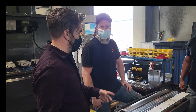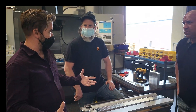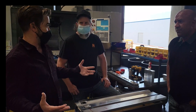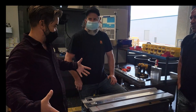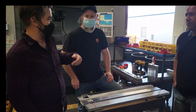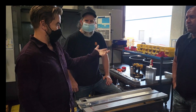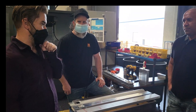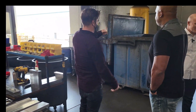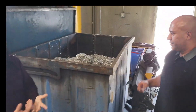Once we start getting into the M series and introduce all the compound curvature across the speaker, with a lot of these aluminum parts we're having to do up to 80 to 85% material removal. So from your solid 500-pound block of aluminum, about 80% plus ends up as aluminum chips over these dumpsters here. We fill up about every four or five days.